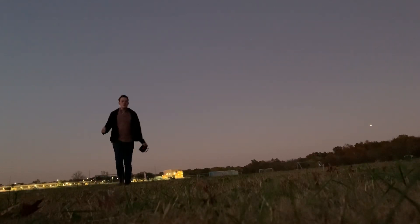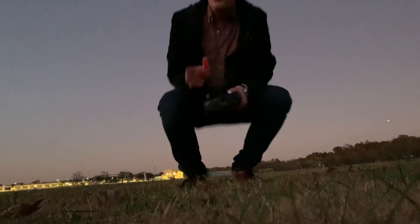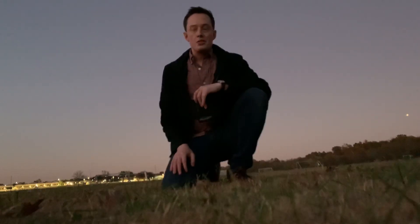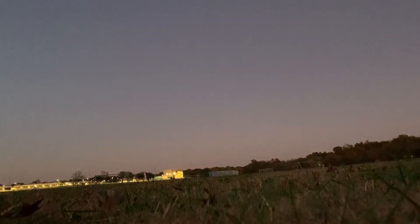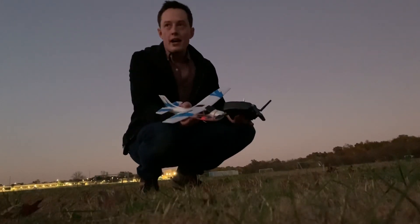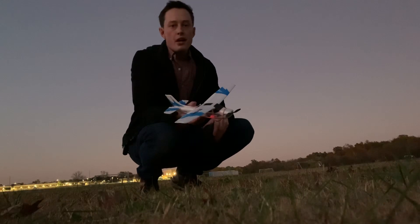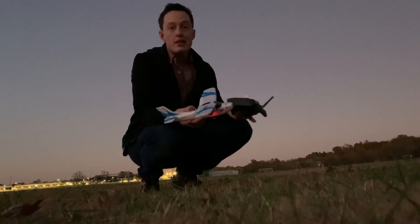The other thing that I have noticed, which does make a lot of sense if you think about it, is that when I get into trouble with this plane — when the rudder starts doing a hard over or the elevators go hard up or hard down because of this gyroscopic issue and I have the stabilization feature on — I can just turn the throttle down, which changes the vibration frequency on the craft. It'll probably bring it down so it vibrates at a lower frequency, and then that starts to play less with the gyros on board.